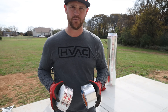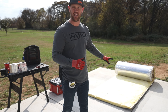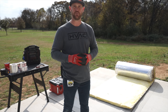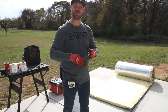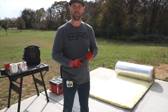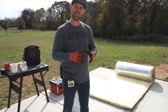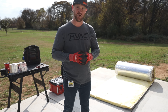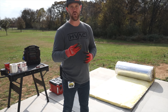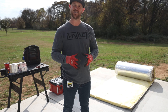I'm going to be working with this 14-inch round pipe along with 3-inch fiberglass insulation, which is an R8 value. Because it's 3-inch thick insulation, the way I measure to wrap around the pipe properly is I take 14 inches and multiply that by pi — 3.14 — which gives you basically 44 inches. Then I add 10 more inches for the thickness of the insulation to go all the way around, plus a 3-inch overlap lip that I can staple and tape down.